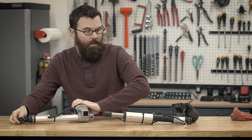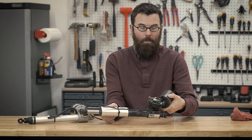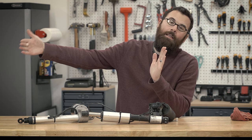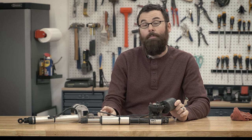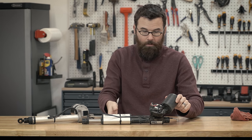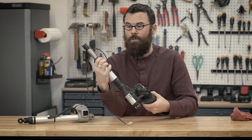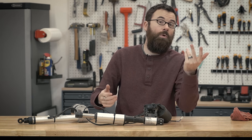This one is similar but a little bit more complicated. You can see it has this collar on here, and it has some wires that feed back to the actual motor — essentially, these are limit switches. The simpler one doesn't have any kind of limit switches, so when you just keep going with it, it'll just keep going out and eventually start spinning because there's nothing to stop it, and when you go all the way in, it will basically stall out the motor. This one has limit switches inside the housing, so when it goes too far in, it'll stop it from moving in that direction, and vice versa. Interestingly, if you look closely at this motor, it's basically a windshield wiper motor — they're using a modified windshield wiper motor in this assembly. But these drive just like any other normal motor: put voltage into the pins, it goes one way; switch the polarity, it goes the other way.